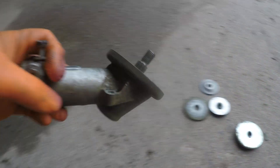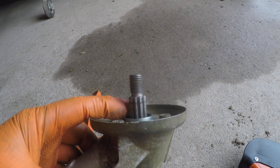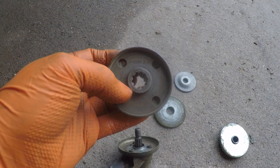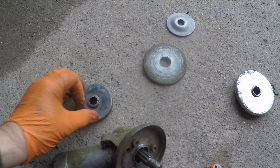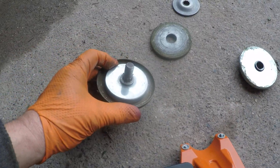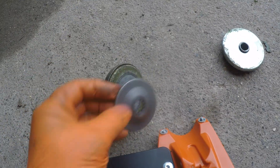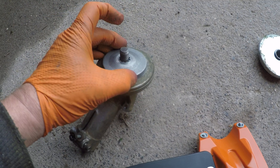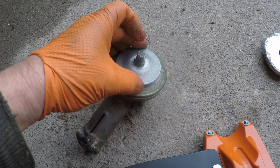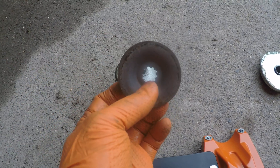Here's the old gear which has no grease point fitted. Another weak point in the old gear is that it's set up with splines that marry with this drive plate which has four little holes in it for locking. Your locking tool comes through there, the splines marry up, the cover plate goes on, then your blade and washer which marries with those splines. But it's not too difficult to have the inner and outer splines — the male and female — not line up, and then you tighten it down and the splines knacker.